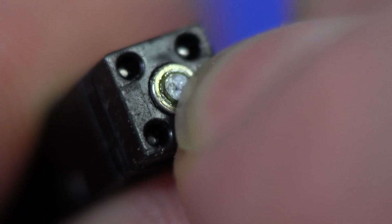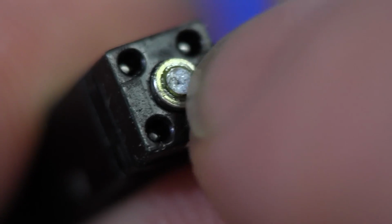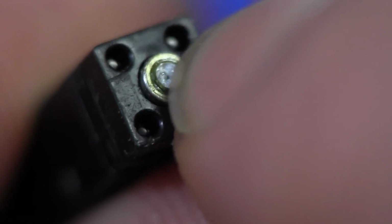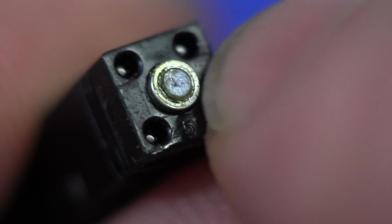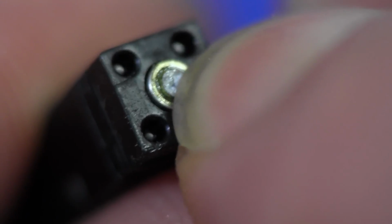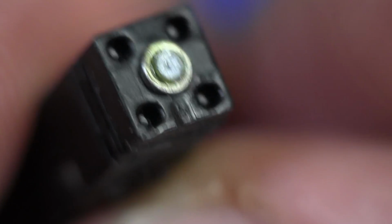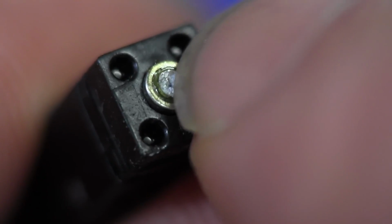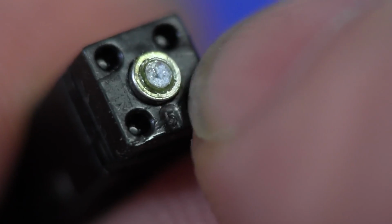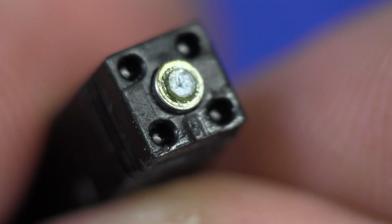This isn't Feel-O-Vision, but trust me, that's probably like a 200 gram force tactile switch in there. So maybe they attach the test probe, and when you put the probe on, it pushes the switch down like that, which then puts the thing into programming slash test mode for production or whatever, and then you use the 2-wire interface, ground and data there. So it's essentially a 1-wire interface to do whatever they need to do during production, I presume.